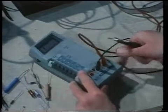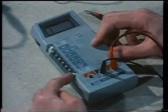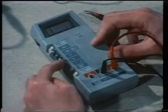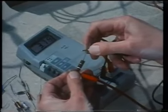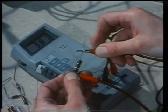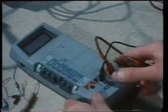Here's another type of digital meter which employs toggle switches at the side for setting the desired scales and values. These must be pushed in to set the meter to read a desired scale. The number 1 in the display window represents the first significant number without an actual value being measured. The method of reading a measured value is the same as seen previously. When you finish using a test meter, it is advisable to cancel your settings and switch off the meter.